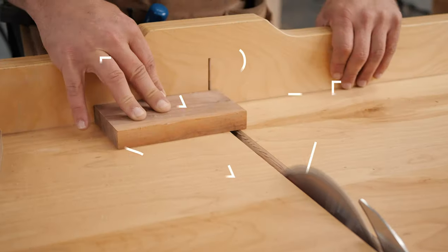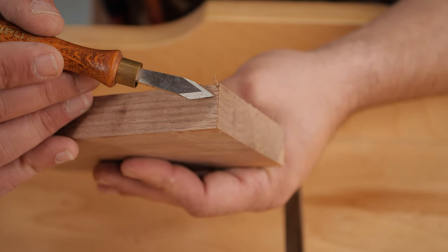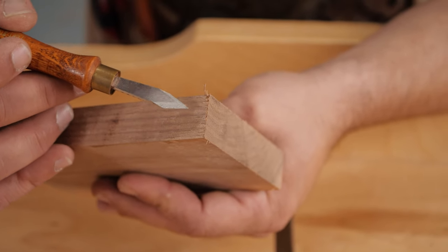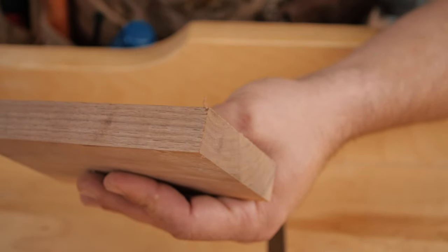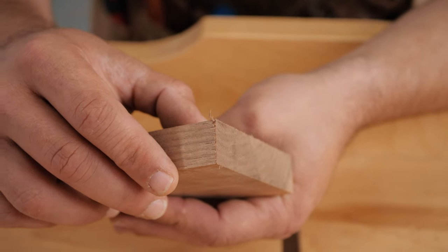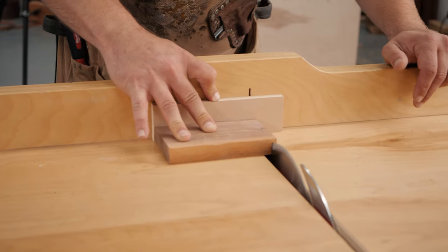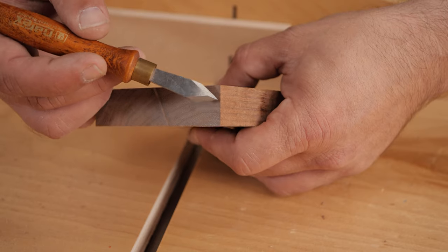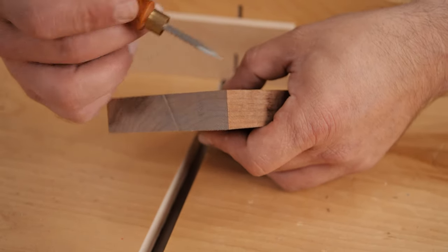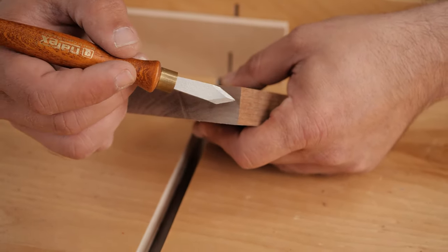Let's head over to the table saw and I'll show you how we accomplish it there. As you can see, when there's no support piece, you're going to get this nasty fuzz here — sometimes it can be a lot worse with a softer wood. There's an easy way to fix this, which is again just with a backer board. What's great about a backer board is you especially want to use it when you're cutting box joints or anything where you're going to be making multiple cross cuts. Now you can see how absolutely clean that cut is. When you're doing finish work and cross cutting, just a simple backer board — anything flat like a piece of MDF or plywood — gives you really fine results.